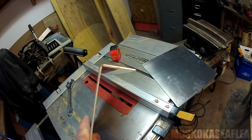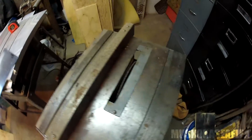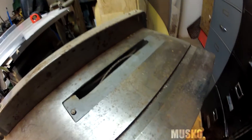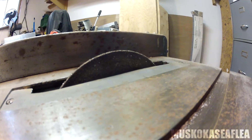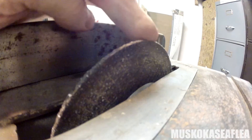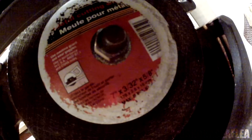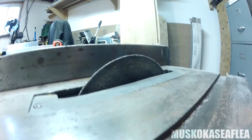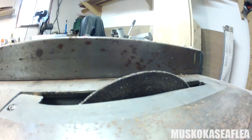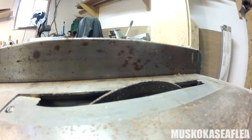I'm going to show you very quickly how I managed to bend this. I've got a fairly clean bend here, and I simply did it in my workshop. I've got an old table saw, and I've mounted a cutoff blade — one of those grinder type blades. It doesn't have teeth; it literally grinds metal. I've mounted it on my old table saw, and I adjusted the height of the table saw so that I was able to score both sides of that aluminum plate.